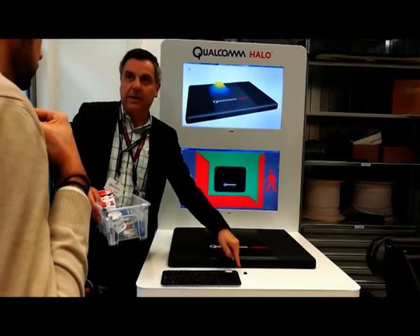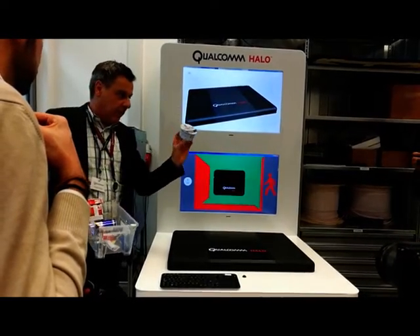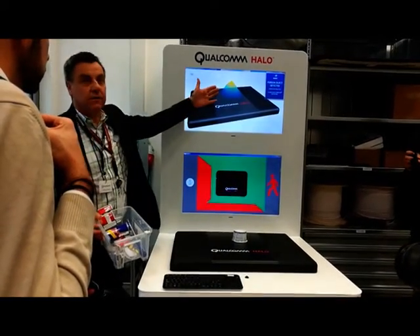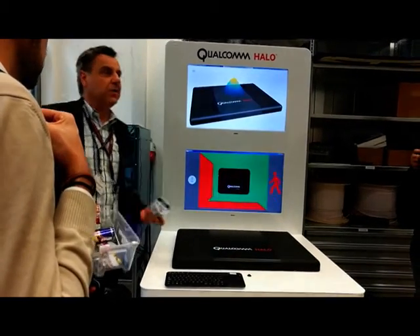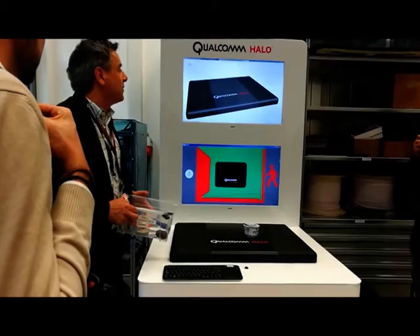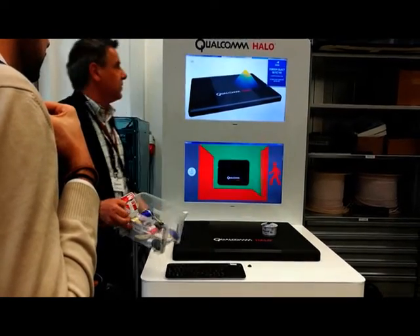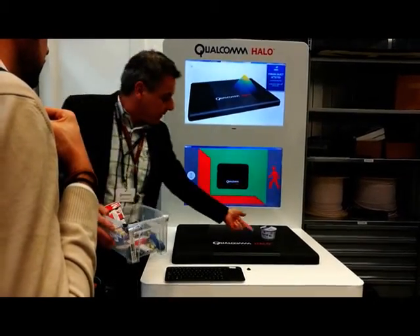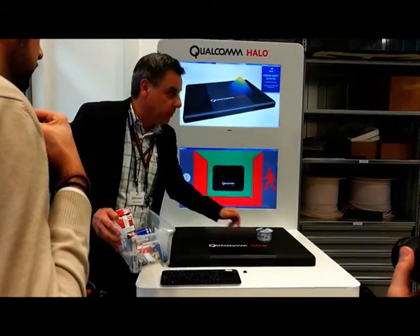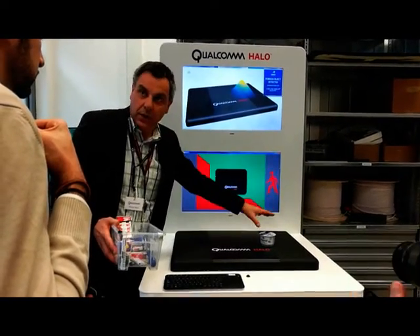There is a list of recommended objects to be detected. For example, the yogurt cup — it has an aluminium cover and if the yogurt cup is right here, it's easy to detect. But in some cases the yogurt cup could be further away — in this demonstration it's about four centimetres above the pad. Even at that distance, the aluminium cover must be detected because it could heat up even away from the base pad, since the magnetic flux passes through and up to that height.